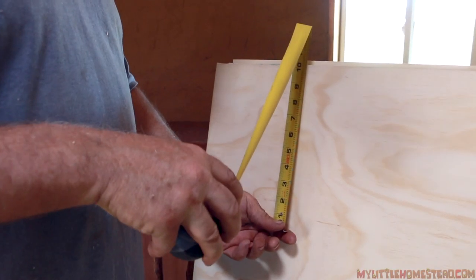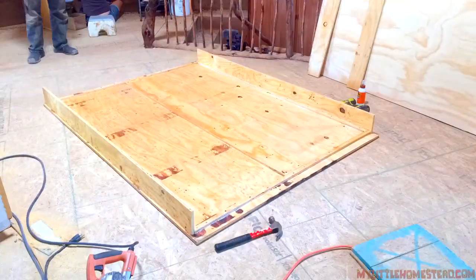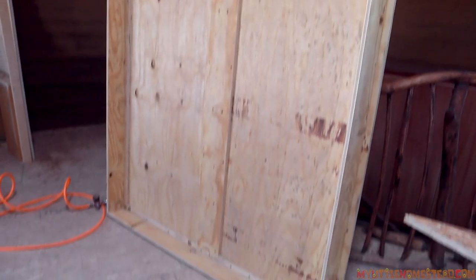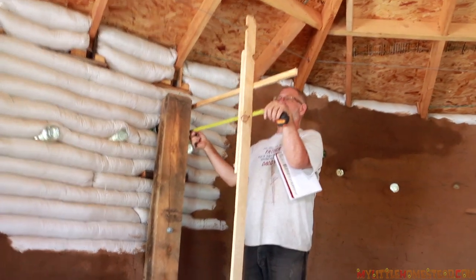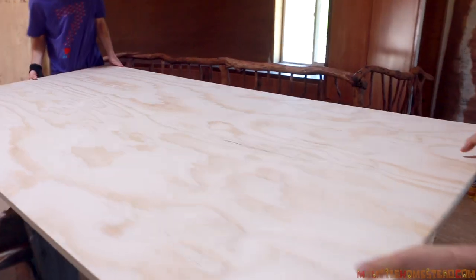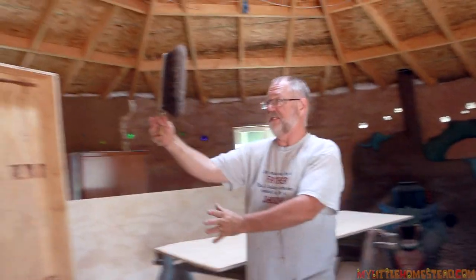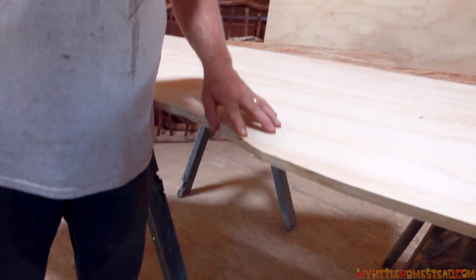The mattresses run somewhere between 7 and 12 inches to the very pillow tops, but when you sit on it you want your legs to be able to go down over the side of the bed, so I think it's about a 5-inch rail and 5-inch header. Today we've put together the box — a couple pieces of plywood screwed and glued. I use a measuring stick, place it where the end of the cabinet will go, and take measurements about every 6 inches across to the wall and cut my piece. It should fit right up against the wall as the right side of our Murphy bed. We've got a few funky cuts next to the cob — hard to make a round cob wall with a straight saw.